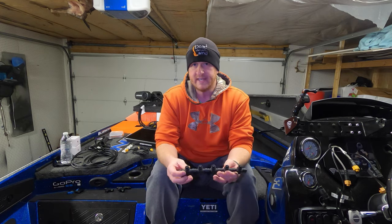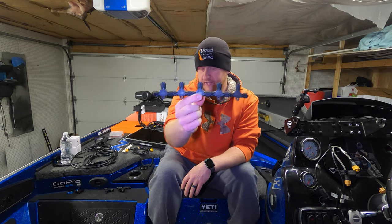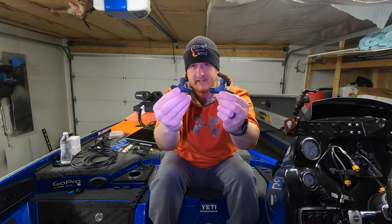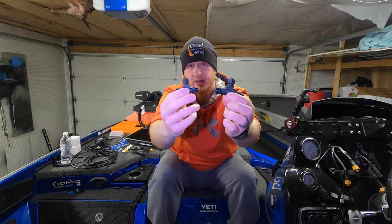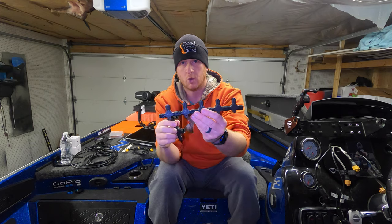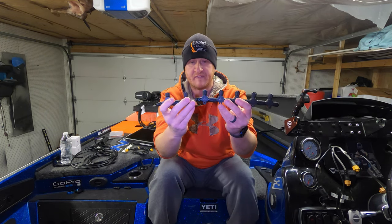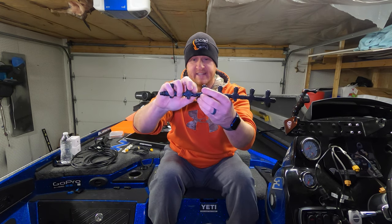As far as how to set up a NMEA 2000 network, it's very simple — I see people overthink this. All the NMEA 2000 network is, it consists of what we call a backbone, which is a bunch of T-connectors that look like this. You just connect them together — they come with a female end, a male end, and then the top of the T. All you're going to do is the obvious: male to female, plug them in and screw them together. Now those two are connected. You have to determine on your boat how many T's you're going to need, and I'll show you what they all do.